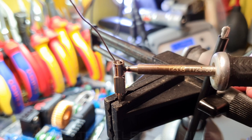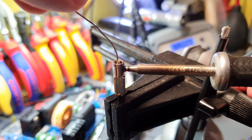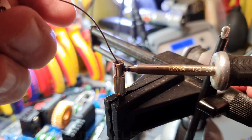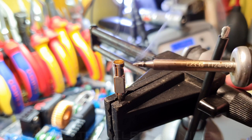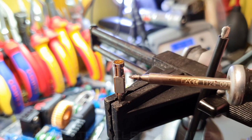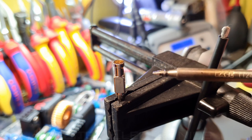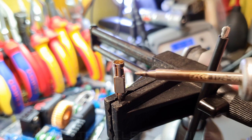I'm going to fill this cup with solder until the flux starts to appear at the top like that. Try not to drag the soldering iron out too quickly because sometimes if you drag it out while it's all hot, the solder will pour out of the hole.